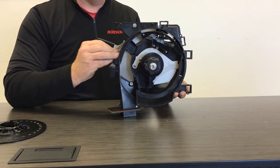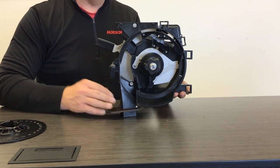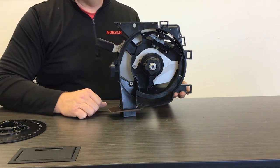You want to have that pile as minimal as possible in order to maintain good seed flow to get seed onto the disc, but also not so much that it can knock seed off the disc as it's traveling through. Consult your owner's manual for the proper settings on the seed door inside the meter.